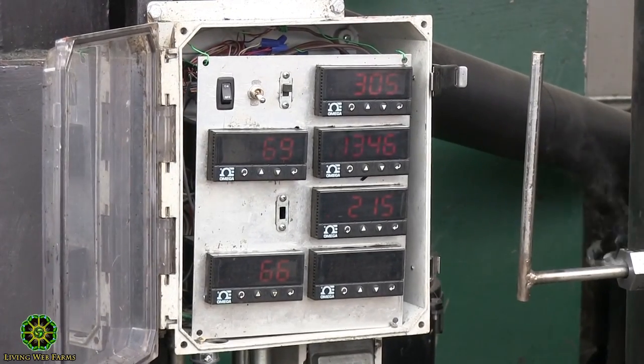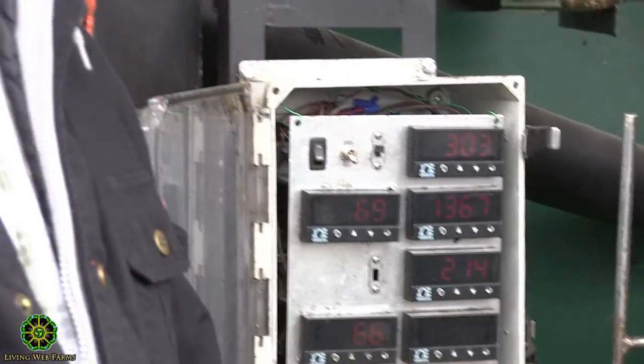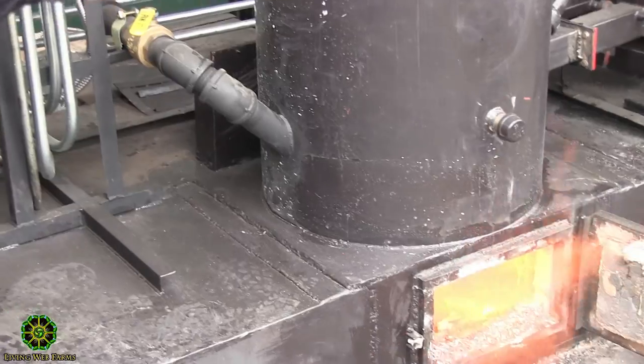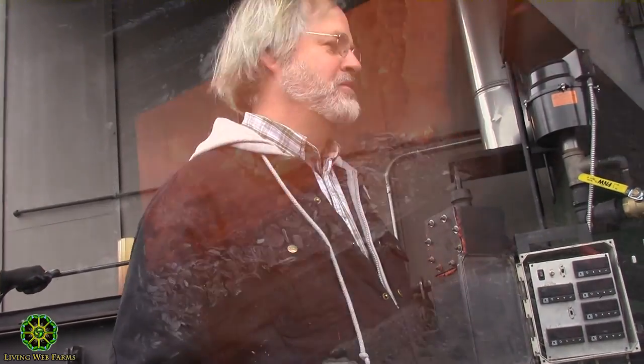Primary thing that we're concerned with, because we want to get as much energy into the retort as fast as we can without burning it. It's a very high alloy stainless steel, very expensive stuff that we're running that heat through, and if you burn a hole in it, I get very upset, but I have done it. I put a 2-foot hole through the bottom of one of the retorts one day because I got it too hot. But how are you going to learn where the limits are until you go over them, right? Expensive mistake.